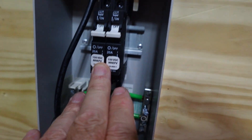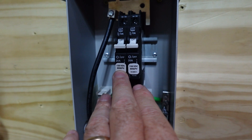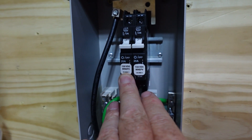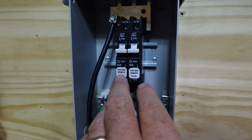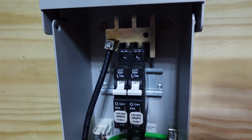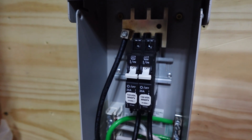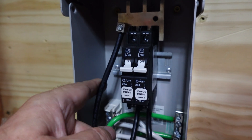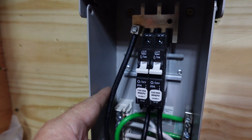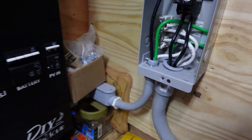With the circuit breakers, they are the MNE PV — PV panel rated, polarized, 20 amperes. They're connected by a bus bar at the top. That's what goes from my two strings in series, combining them so that way we're going parallel. And then we're running our hot wire all the way down in.